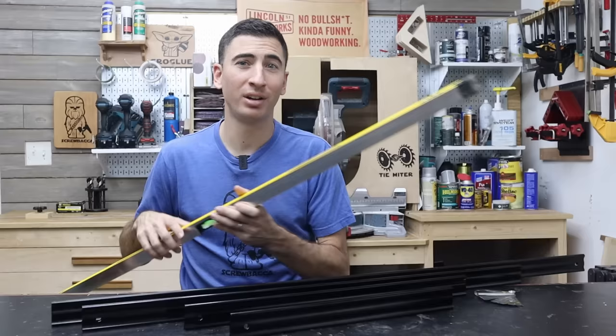I recommend aluminum straight edges. I think the steel is overkill and can be almost 2 times the cost. These come in sizes from 18 to 50 inches. I personally wouldn't go any smaller than the 38-inch version though. To maximize the effectiveness of your straight edge when dialing in your tools, get a set of feeler gauges which help measure in increments of thousandths of an inch. Great news! If you've been paying attention, you've got an extra $300 or so dollars in your pocket.